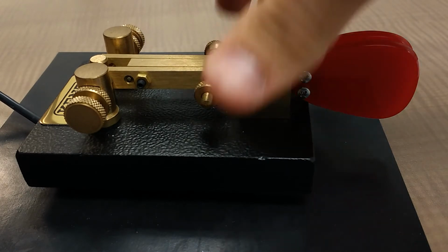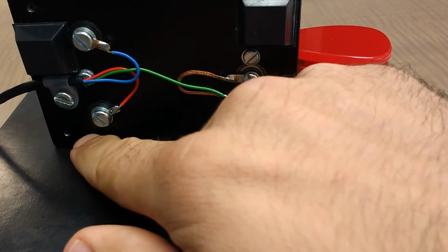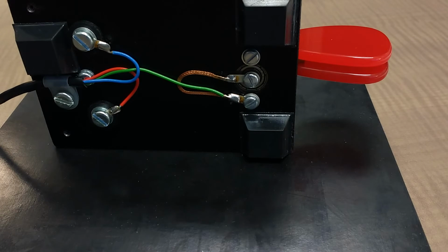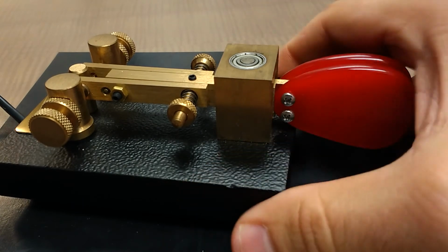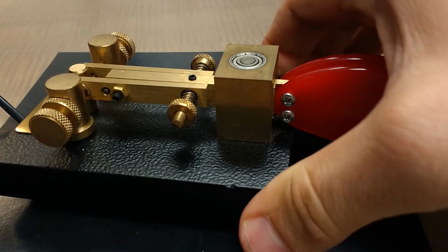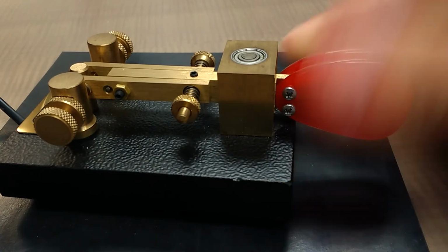Second, I removed the original screw-on feet. It's down over here, and they were beautiful. They had tapped into each hole, a small screw mounting each one on. It's not often you see keys with screw-on feet, but those rubber feet were a bit thin-walled because of the screw having to pass through, and they're also a bit soft, so when this key was really moving, it would tend to kind of sway around to that motion because there really wasn't enough meat to the rubber to stay in place, and there being such a small contact area, it would also occasionally slip around as well.